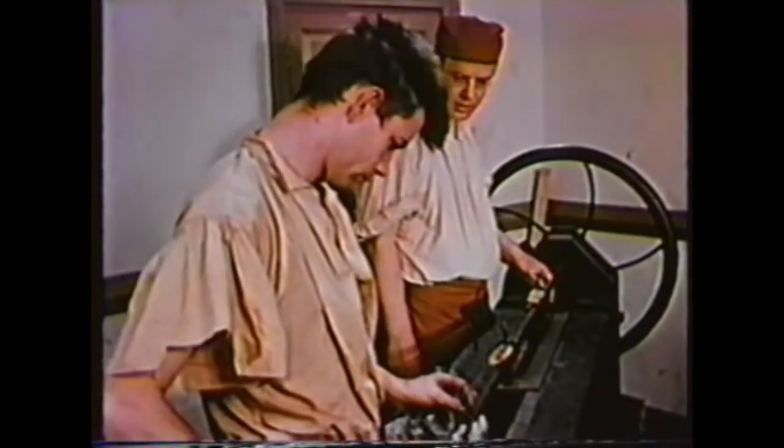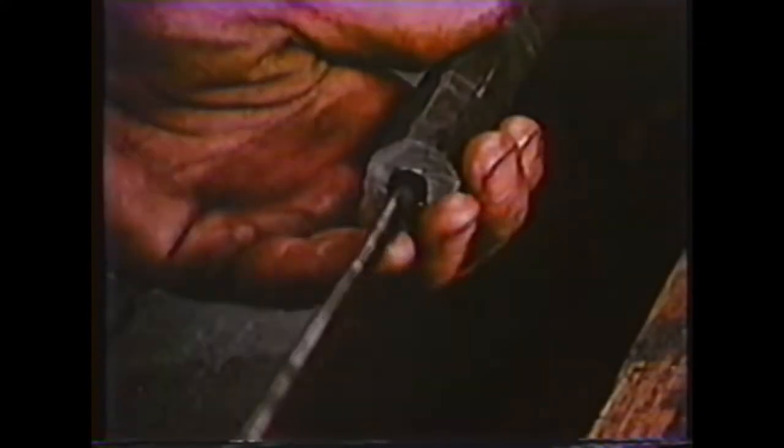When you're taking a heavy cut you have to clean off the bits every inch or so. The borings are saved and used for flux. Occasionally the barrel is cleaned and checked for straightness. Bends and crooks can be seen by sighting through it at the window. These can be hammered out on the anvil. All this is gauged by the eye — no straightening device is used.